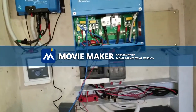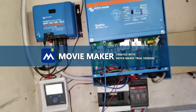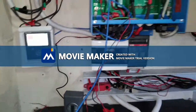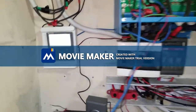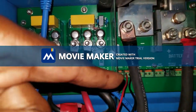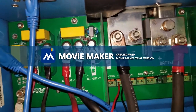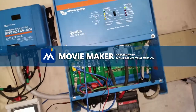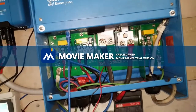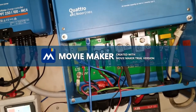We don't have a BMS — to be clear, we don't have one. We're using a battery monitor. We spent two days figuring this out. What the battery monitor does is open and close a relay, and we're using the temperature sensor as our relay. If it's open, it allows the batteries to charge; if it's closed, it doesn't allow the batteries to charge.